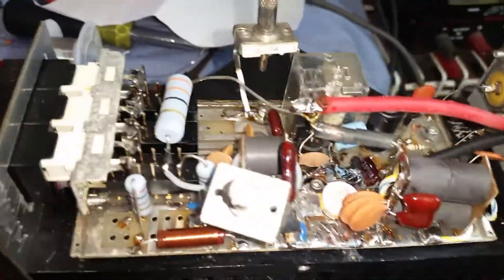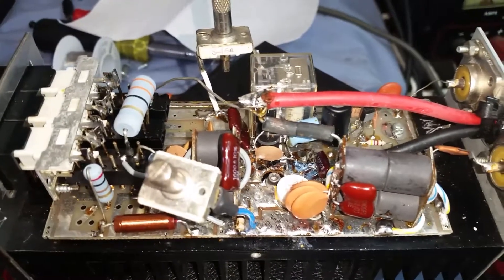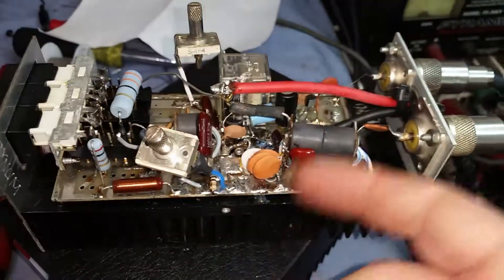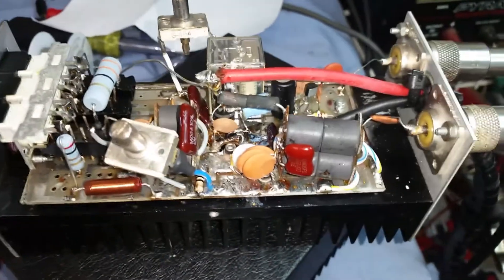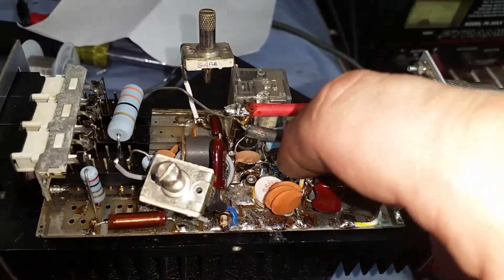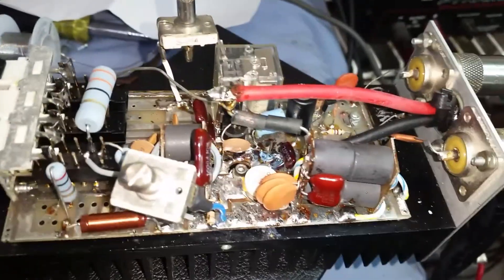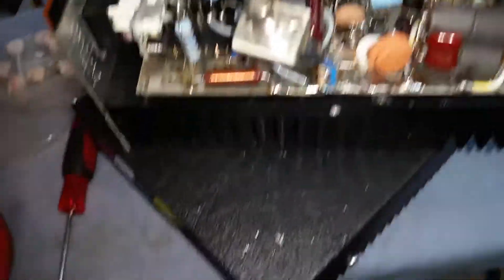Not even the Super V111 has bias going to it, if I remember correctly. I'd have to double-check that. I would think that amp would have bias, since they put it in the 350-250 cabinet. But I basically took it down to the modulator plus circuit. It's got a 1,600 puff cap right there. I went ahead and put your cap from the collector to ground, got you a new tin on them. I had to re-wrap, and went ahead and soldered your tabs right here — which is what I always do to make sure those never oxidize.